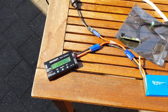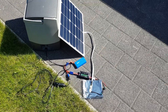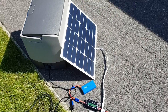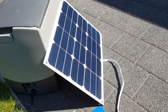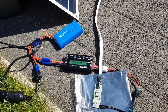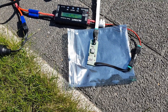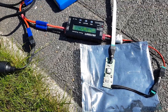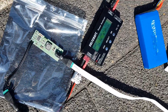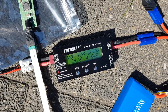By connecting also the solar panel and the small charge controller. So I hooked up the complete system. The solar panel goes to the small charge controller. Just to see how much power it gives I connected the power meter — let me turn this around a little bit. So it says currently that it is charging with 24 watts.